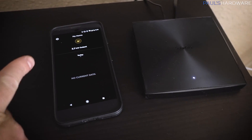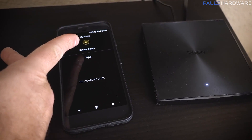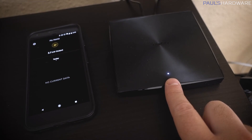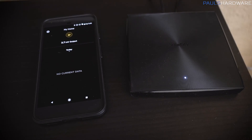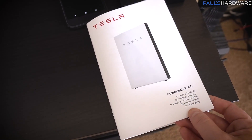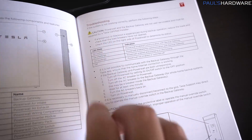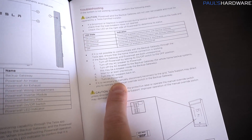I think I made some progress because we can now see the actual output — 3.7 kilowatts from the solar array. So I think I got the solar array properly communicating back to the home server and delivering information to the app. The gateway light hasn't turned green though — it's supposed to turn green once everything's good to go. Although it does seem to have an internet connection, so I don't think anything is really wrong there. I have emailed Tesla with the present situation. In the meantime, because I like to do things myself, I've decided to make the bold choice to RTFM. We do have a Powerwall manual here, and there is a troubleshooting section that goes over what to do if the Powerwall and the backup gateway are not communicating with the server — basically a glorified turn it off and back on again.